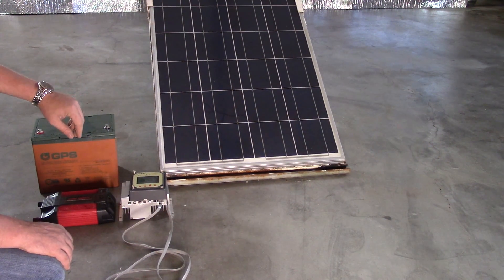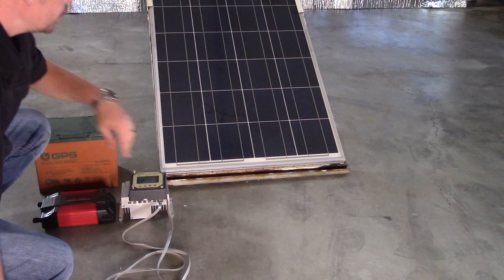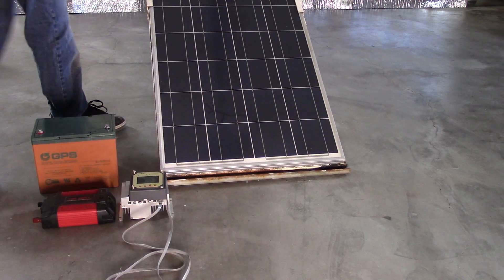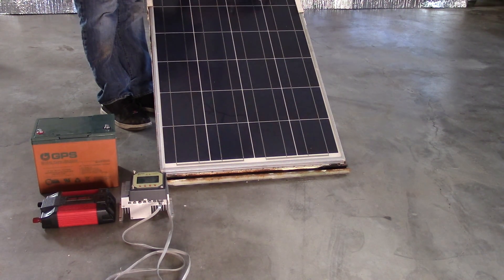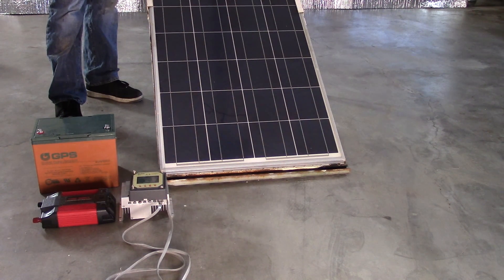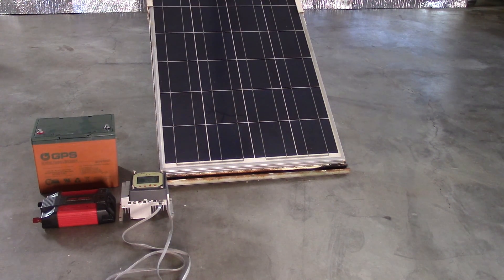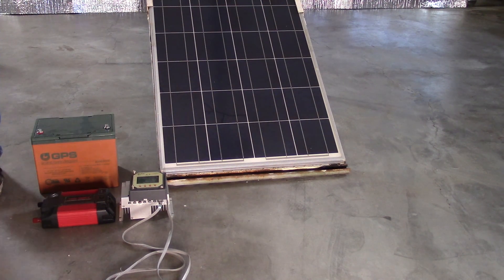For solar panels — this is an Ames solar panel, about four years old. You can see there are cracks in three or four cells here, and more here — about six cells have cracked over four or five years. It still outputs about the same power, but the cracked cells are getting hot when I charge off it. You can see that with a thermal imaging camera. So you need to get high quality solar panels.